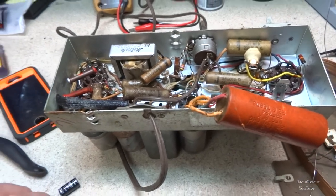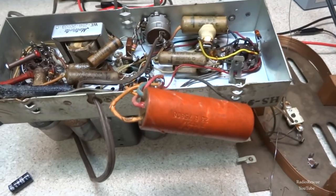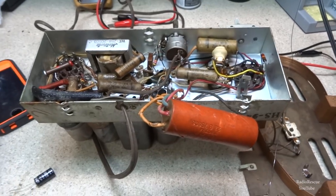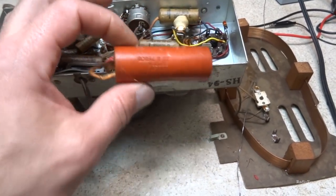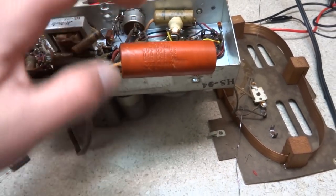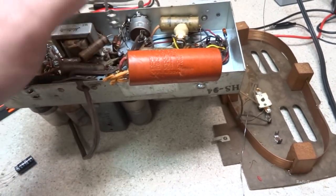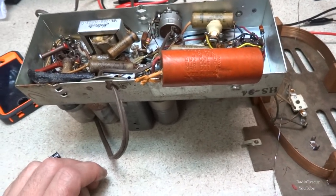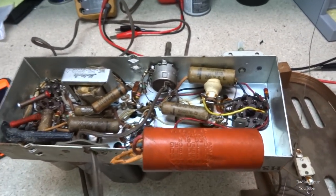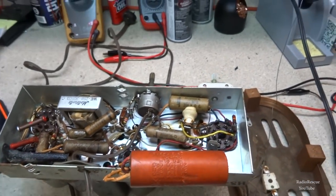Alright, so it's been a little while since I've gotten in depth about how to do this, and just in case there's some new subscribers out there that may want to know how to replace these filter caps if your radio's humming when you turn it on, it's going to be the filter cap most likely, and in these old sets, this is pretty much what they look like. Sometimes they'll be standing up, mounted on the chassis itself, and then a wire coming out the bottom, and it'll be grounded to chassis. If it's a transformer operated set, it's most likely going to be grounded through the chassis. But on these transformer-less sets, they have what they call a floating ground.